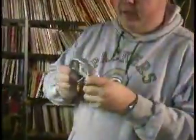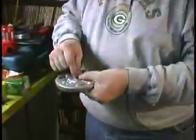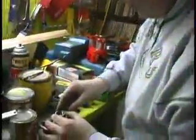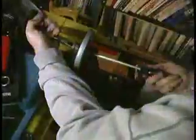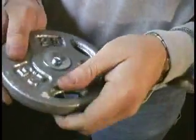For the counterweight, take your bolt and put a washer at the end, then put that through the hole of the weights. It's going to flop around a bit while we're setting this up, so be aware. Put another washer — one of the giant flange washers — down to cover the hole, then take a locking washer and put that there, and another locking washer inside. This is going to be cramped quarters, so it'll be a little tricky. Basically grasp the nut inside and tighten this up — we've wedged this washer, which is going to stabilize the entire setup.